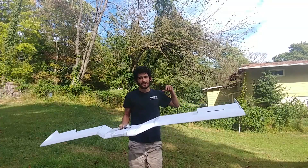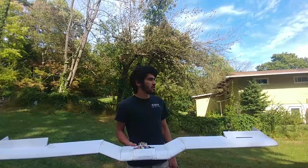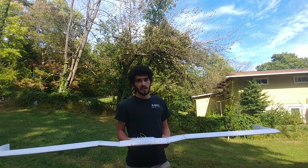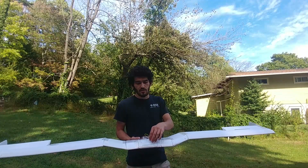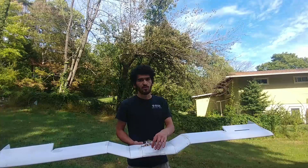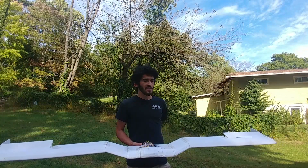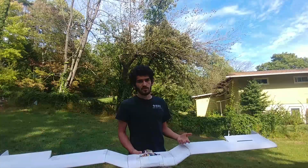It might be too small — too small given the speed we're trying to operate at, so it can't pull the nose back up fast enough. What I've done right now is pull the center of gravity back. I'm probably going to start removing weight from the nose and moving the CG back, which is going to decrease stability. But we have a computer on board for that.